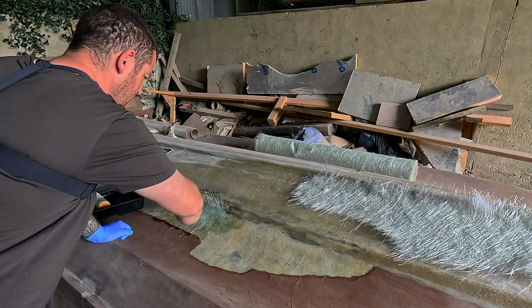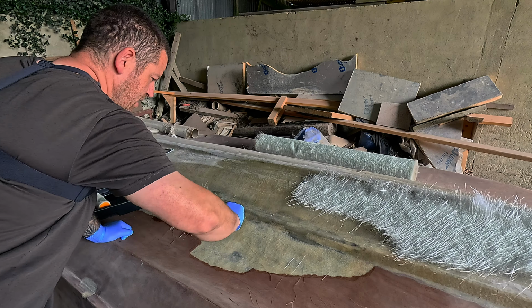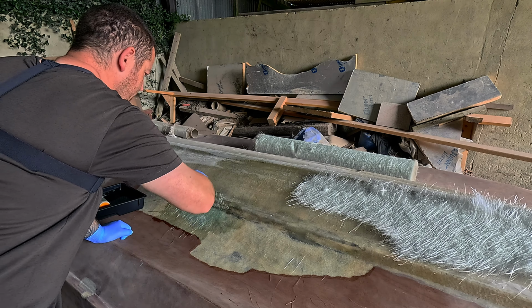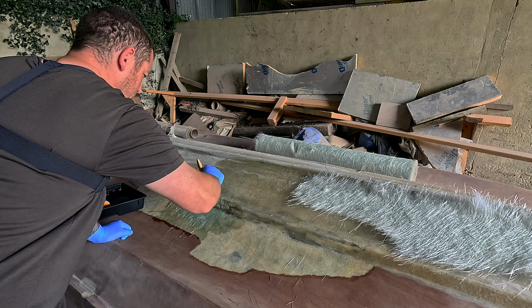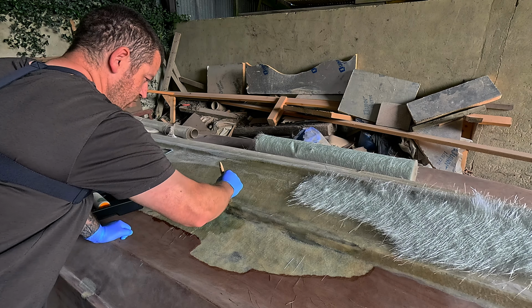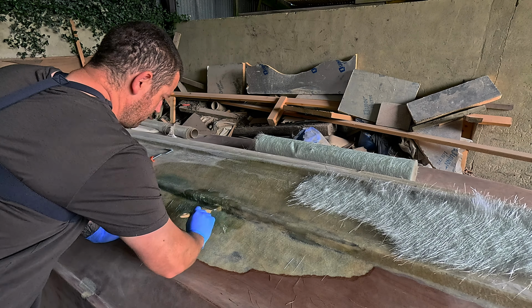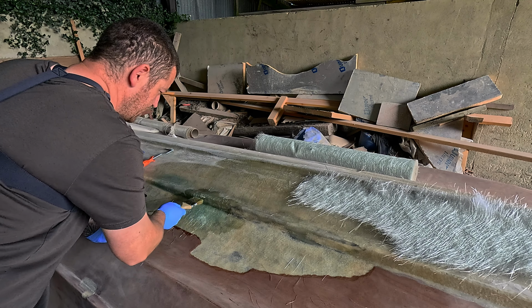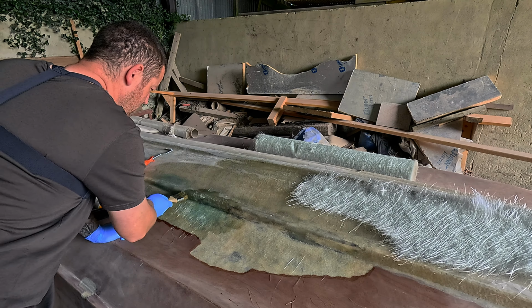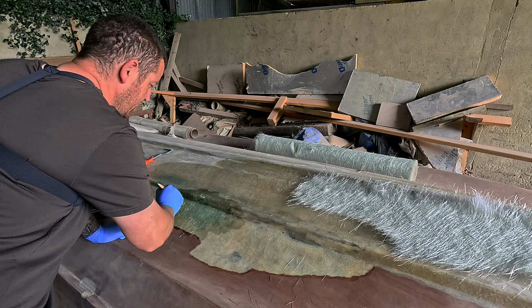And you don't want to be dabbing too hard in the corners on them edges because you just start stretching the matting. So what you want to do is lay it down like this, gently. Obviously not working too slowly as well, and make sure you wet it out nice. You can oversaturate it, but at this stage now, we are okay because we've got another 2 layers of mat going on top. If this was the finished layer right here, you won't want to be banging this much resin on because you're going to oversaturate it and it'll be too resin rich, as they call it.